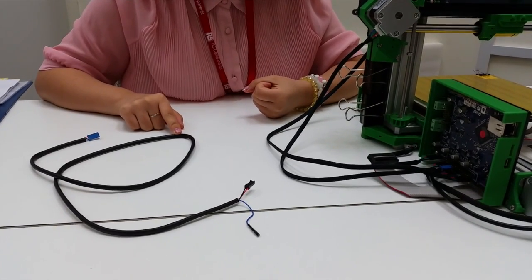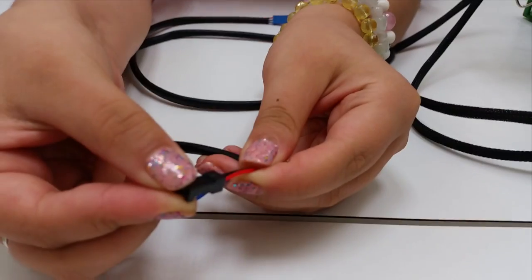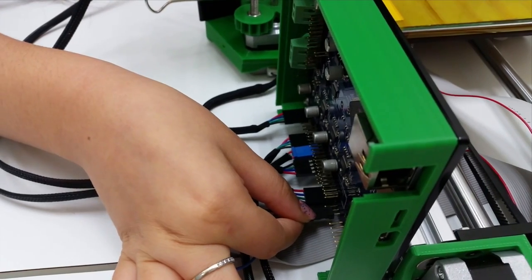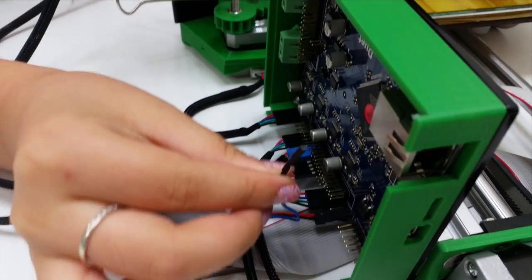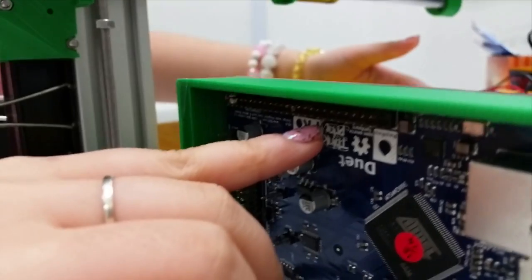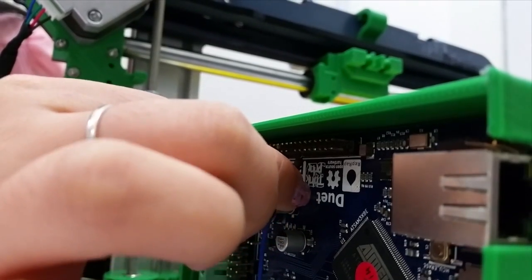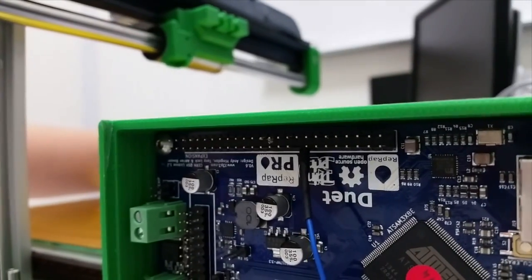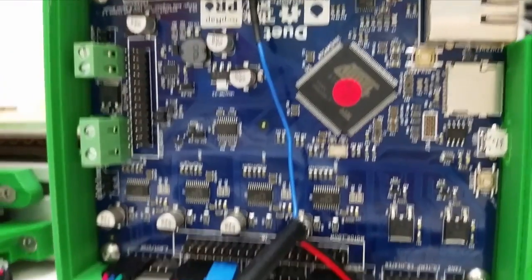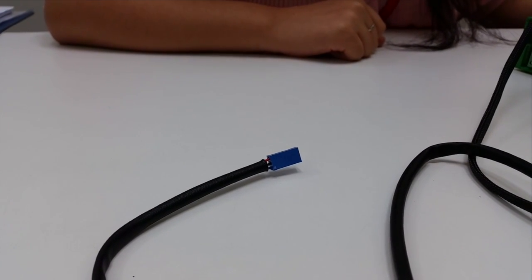This is the next wire used to connect to a sensor. The red wire will be facing inward when you connect it. This extra wire will be connected to the pin on the top — you have to bend these pins for easy connection. Leave the other end of the wire unconnected for now.